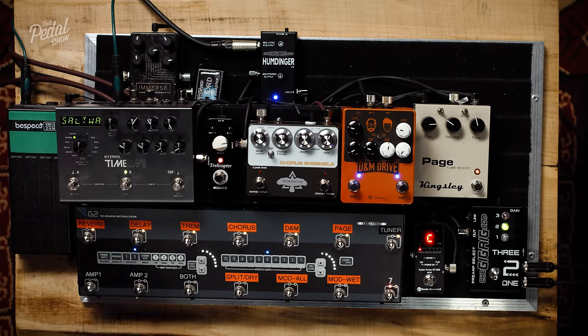Okay, so this is all three amplifiers on at once, okay? At this point, the modulation is after the split, but we don't have anything on at the moment. We just have the Tele going into all three amplifiers. Sorry, if the modulation is going after the split, that means it's only going into the wet amps. The modulation is before the split at the moment, so it's going into all amps. So with the modulation, the modulation is after the split. You are absolutely correct. The modulation is after the split. So the modulation is only going to the outside amps.